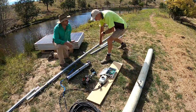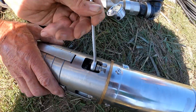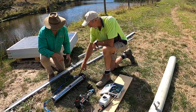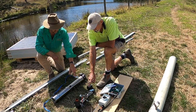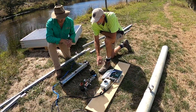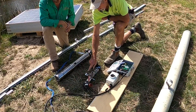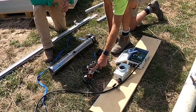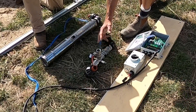Well, it looks like you have been busy, mate. You've got a few things sorted out here — it looks impressive. You've got your pump assembled. That just came in two parts, just stainless steel nuts. Put that together and I've started with some of the plumbing fittings here — just put an angle on the top, right angle there. This is your delivery manifold — the pump supplies into this point here, comes up through here. We have a pressure gauge, pressure switch, and there is a non-return valve in there so water can't drain back down through the pump if it stops. And there's a delivery shutoff.